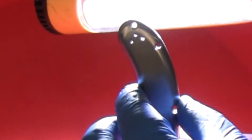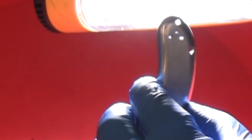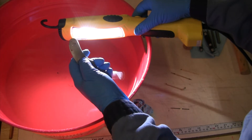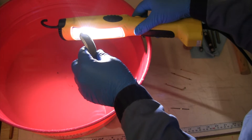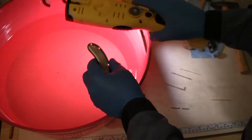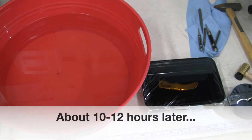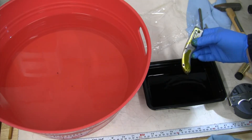Hopefully that shows up — we definitely have light coming back through all three of those holes, so we've got enough area cleaned up. I can see the little piece of tap left stuck in the middle. Now the ferric chloride should be able to get all around it. It's similar to what we had left in the other hole last time, so there's just a little piece left in there — just a little more than we're able to knock out right now. Back in the ferric chloride it goes and we should be completely tap-free by this evening.